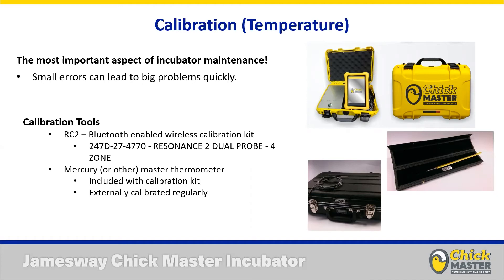For calibration tools, first you're going to need a decent calibration box. Through Chickmaster over the last couple of years we've had two main kits available. The current one, the RC2 visible in the top right of the screen, is a wireless calibration kit — it's exactly the same functionally as the older kit but wireless, so you can put it on top of your incubator without mains wires running through the corridor creating a trip hazard in a wash-down area, and link it to any Bluetooth-enabled tablet. The older black suitcase kit at the bottom of the image holds up to eight probes, but must be situated in front of the incubator and plugged in.